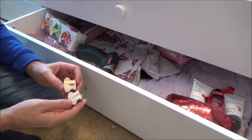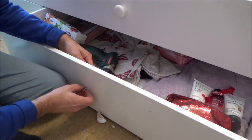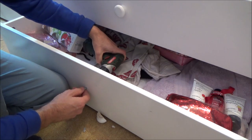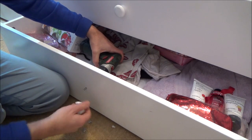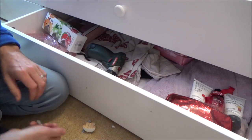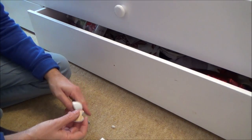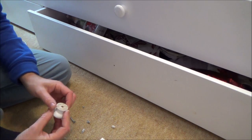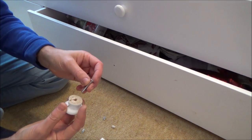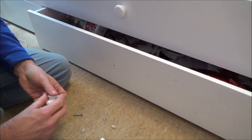That wasn't very successful — the handle has split. That's annoying, I'll have to find another handle. Sometimes fixes work and sometimes they go terribly wrong, and this was one that went very very wrong. In hindsight, I should have just used a bigger screw. What went wrong is there was too much material and not enough hole — it split the soft wood because the plastic had nowhere else to go.